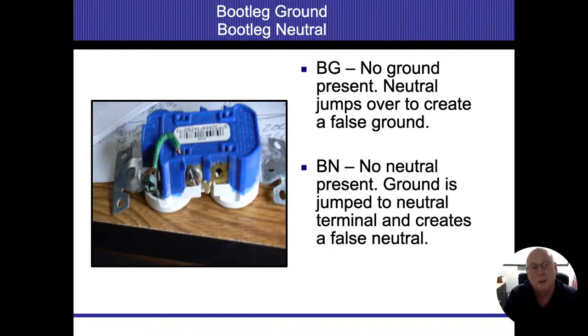Now, will this work if I have a wire come loose and an energized case? Yeah, it will. That will go ahead and get the wire over to the neutral. But in all reality, because the neutral always carries amperage, we said amperage doesn't disappear. And if it's 120, doing something like this is basically the same thing as bonding a sub panel. We're putting that particular ground and that particular neutral together. And if I have another ground path coming in there, I'm actually inviting amperage on my grounding system. And that we just don't want to do.